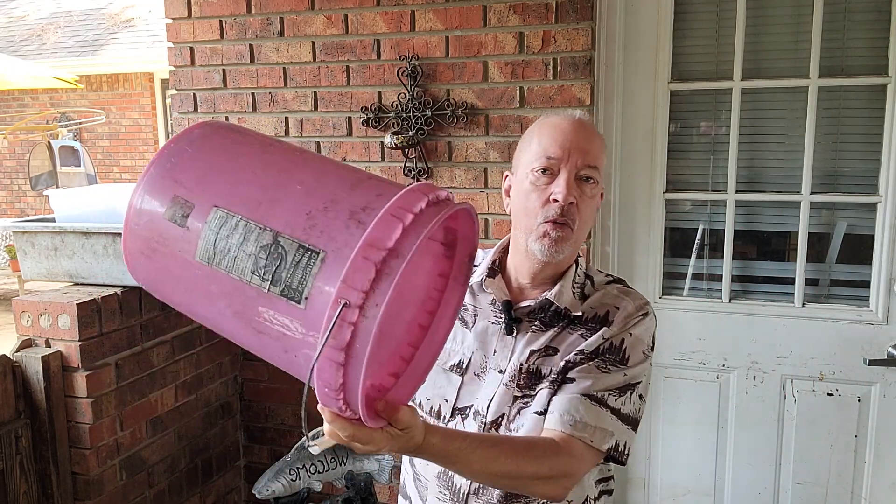While we're waiting for that to heat up, a quick safety tip. Whenever I'm working with any kind of process that involves an exothermic reaction and there is a risk that that reaction could potentially get out of hand, I'll always keep a dump bucket handy — a five-gallon bucket full of water. There's no water in this one right now because there's not much of a risk of a runaway exothermic reaction with this particular process. But it's a great idea to keep one handy; if the reaction does start getting out of hand, I can just scrape everything off into the bucket and run.